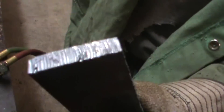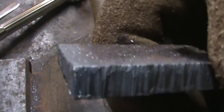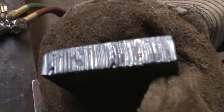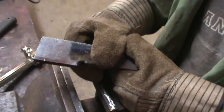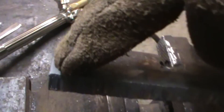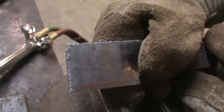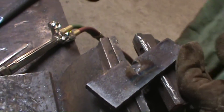Now if I was going to weld this, I'd probably take a wire wheel and get all this stuff off here. But if we go ahead and pick this cut apart a little bit — maybe along this top edge, it could have been possibly a little hot — but I'm pretty happy with the way that cut turned out. Just one of the main quality things with cuts is these lines — they're nice and straight, so you can tell it wasn't traveling too fast. Bottom side, there wasn't much slag and what slag there was chipped off easy. Top side maybe a little bit hot just because this corner is not real sharp. But for the most part I would be happy with a cut like that and it's going to get the job done. If you guys have any more questions or want me to do anything else with the torch, just leave a comment. Thanks for watching guys.